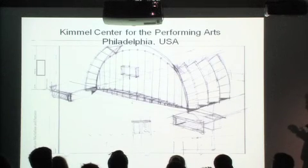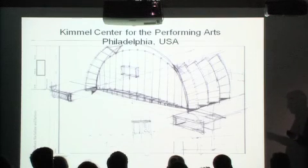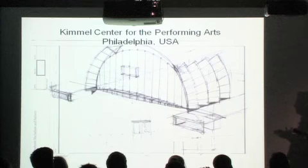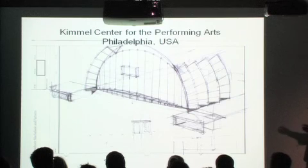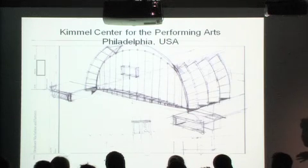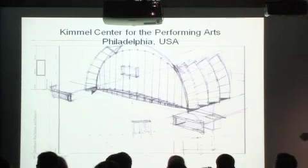which for an engineer and an arch, I have never seen an arch. They're theoretically the perfect structure, but they are never theoretically perfectly loaded. And therefore, they're always bending, right? This is the first arch I was ever able to design that got no bending in it, or very little bending, which means that size, it's all in compression then, and when something's in compression, it can be quite small. As soon as you put unequal load, it goes into bending, and then it needs to go quite deep. So we could build something which was really quite small there.